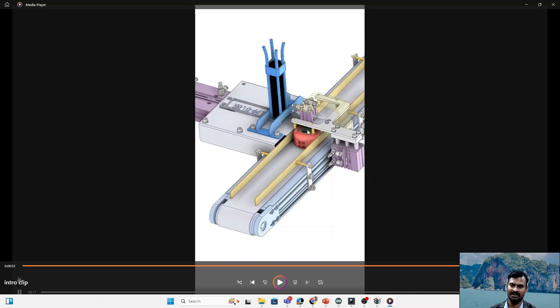Once the pushing is done, the object coming from here is settled down. Then the stamping cylinder goes down and gives a gentle press so that it is fixed on the preliminary object. Once this operation is done, the pushing cylinder and the stamping cylinder retract back. Once retracted, the lifting cylinder again moves up, releasing the object. Once the object moves away, it comes back to the home position. This is one complete sequence of operation for this particular activity.